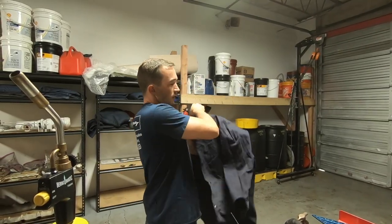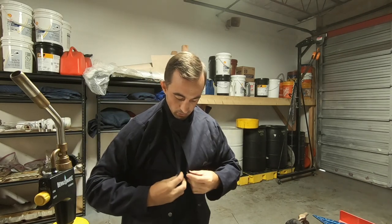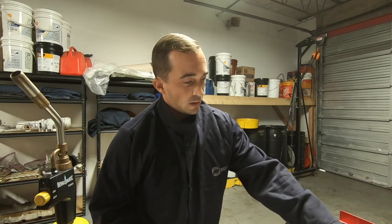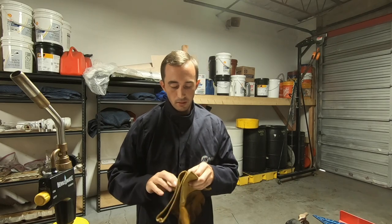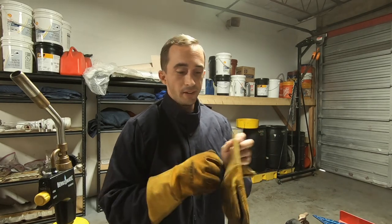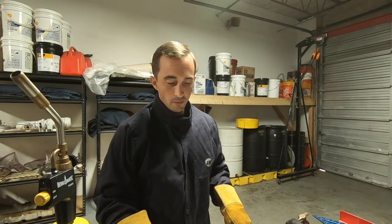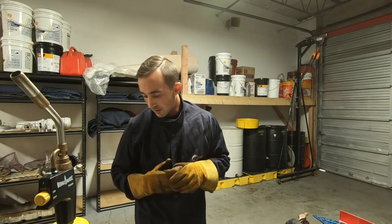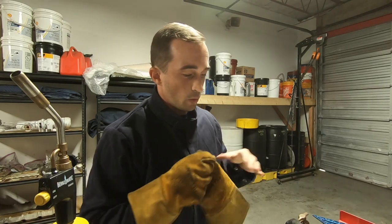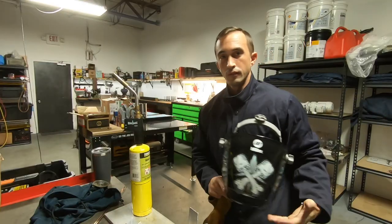Safety first — we've got a Miller welding jacket I picked up on Amazon for about 20 bucks, good value and it even says Miller on it. We've got some Tillman 35L gloves — not the thinnest, not the thickest, kind of what I like, but everybody has a different preference. We've got some aluminum filler rod, aluminum in front of us, our foot pedal set up, our ground, our makeshift workbench, and our hood. I'm going to go grind the tungsten quick, because that's where you want to start when TIG welding — make sure you've got a clean tungsten — and then we'll go from there.